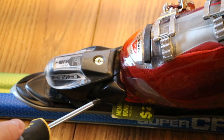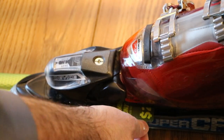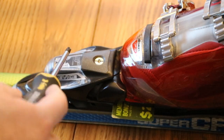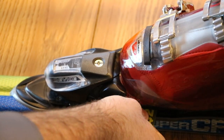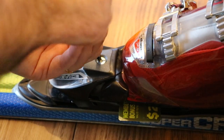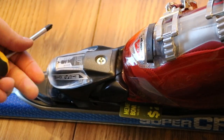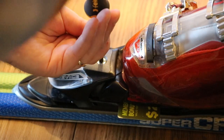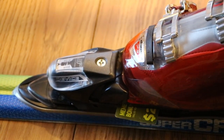In my case this card is 0.35mm, so if it's set properly for half a millimeter, this card will come out pretty easily since it's thinner. So I keep backing the screw out — another half turn, another quarter turn — until the card goes in and out very easily. Going one quarter turn too far and it's almost falling out, so one quarter turn back is right where I want it set.